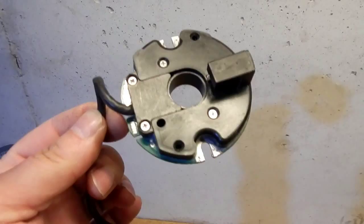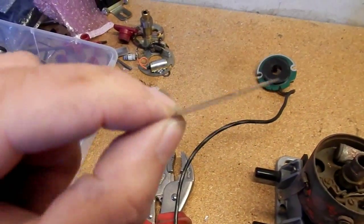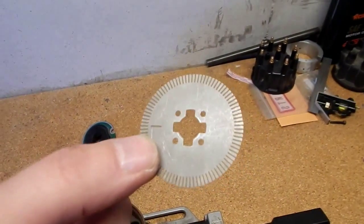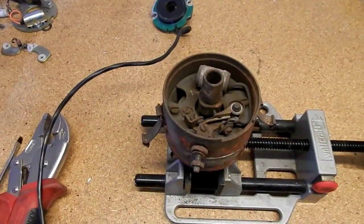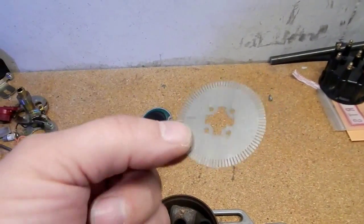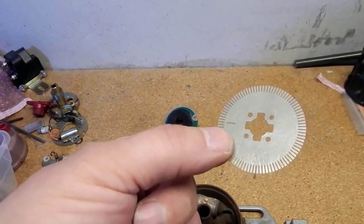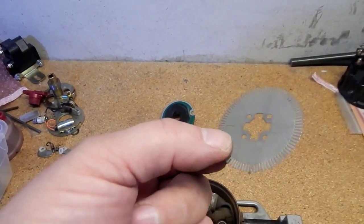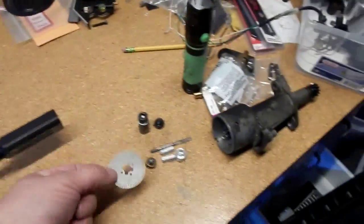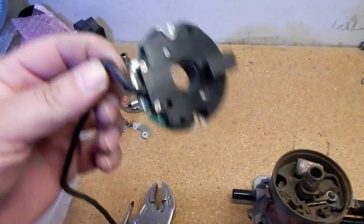This uses a timing disc which can record engine rotation. There are 90 slots in this disc — it's a stainless steel disc. 90 times per rotation, this computer knows exactly what the engine is doing: how fast it's accelerating or slowing down, what RPM it is, so it knows exactly what the timing should be. It never changes based on temperature, humidity, or magnetic interference from your timing parts spinning around in there. This is absolutely nuts-on perfect all the time. All of our ignition kits at C5 Performance use nothing but American-manufactured Power Arc electronics, and we manufacture everything else here in Wisconsin.